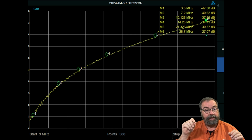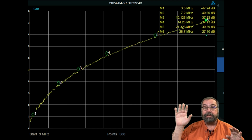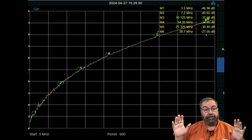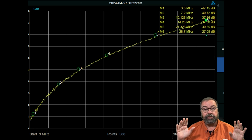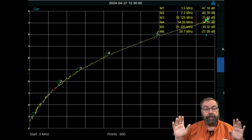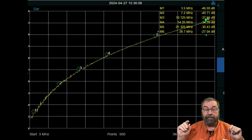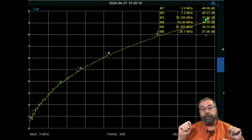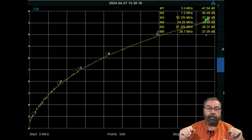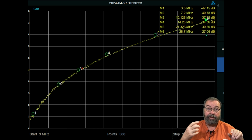The other thing that I have heard, and this is anecdotal evidence, okay? I saw another video by W2AEW where he was checking an Alpha Delta switch, and he showed the isolation on the Alpha Delta switch, which was tremendous. And you should go check out his video, W2AEW, Alan Wolke, or Wolke, I don't know how you say his last name, W-O-L-K-E. Alan's a pretty smart guy, smarter than me. And he referred to a discussion he had had with Rob Sherwood of Sherwood Radio Reports, that guy. And Rob had indicated to him that almost all radios can accept at least 20 dB into the antenna input.